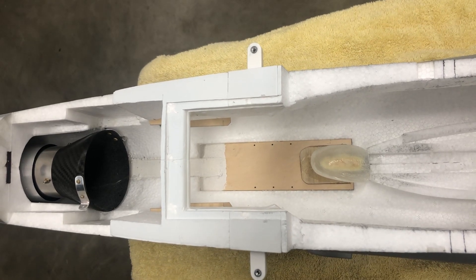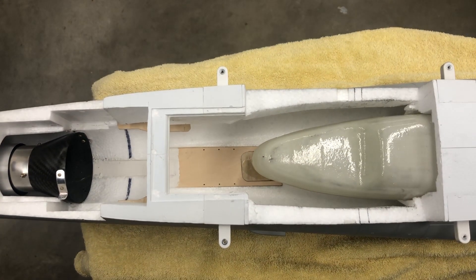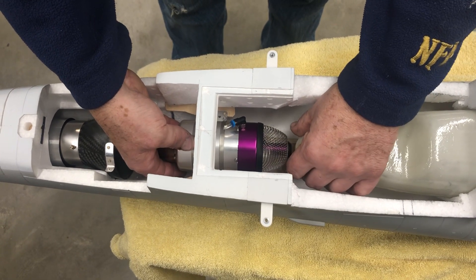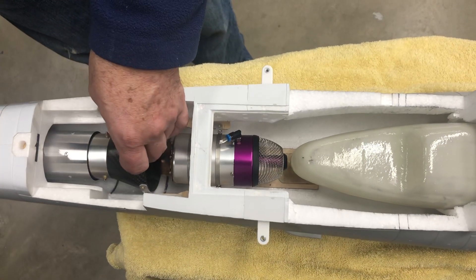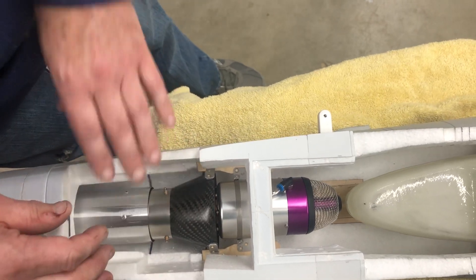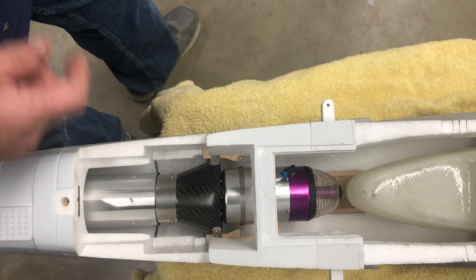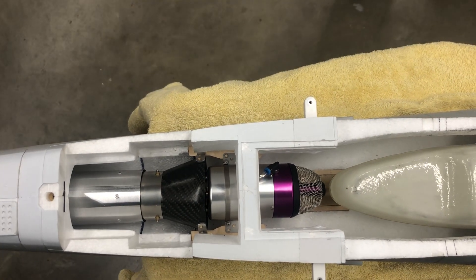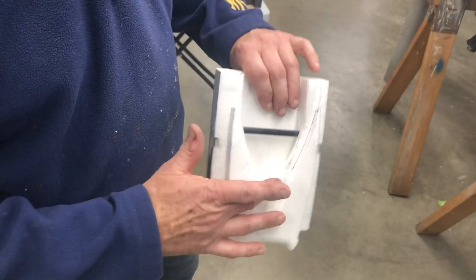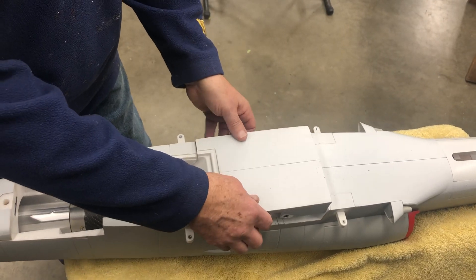Then you can actually glue in the tank. With the pipe shifted back, the engine's going to go in like this. I like to keep about an eighth-inch gap between the tank and the engine. Then the pipe goes back. I like to locate the pipe directly in line with the back of the engine mounting bolts. Once the mounts are glued in, I'll take a lot of time and try to position the engine and pipe as best I can right on center line. I'll drill them, and basically everything's located at the bottom of the model. I did the same thing with the carbon paper. The spar goes behind the tank — everything's looking good. This is pretty much an exact fit on the tank back here, so I'll apply a little Gorilla Glue when I set this in permanently and everything's going to be fine.